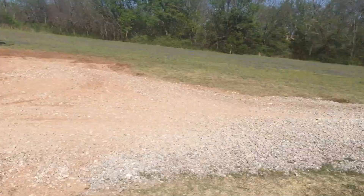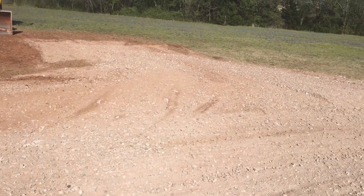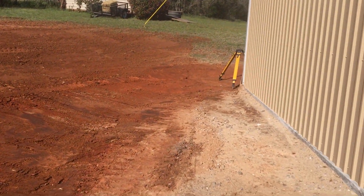This is what I've been working on today — a little driveway project. We're going to put some more rock on it. Made a little turnaround area here for backing out and turning around; I'm going to widen that when we get more rock up here — it's a little narrow and needs to shift out just a bit. I put in some smooth river rock in this area here — they wanted something they can walk barefoot on. I dug this out just a little bit to let the water drain better, and then there's some drainage we'll cut around here with the laser on the backhoe.